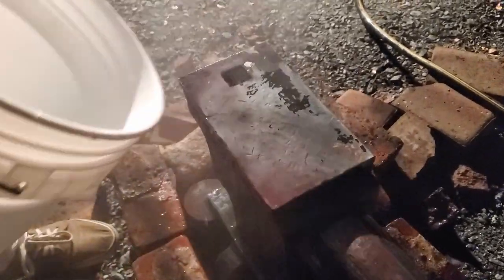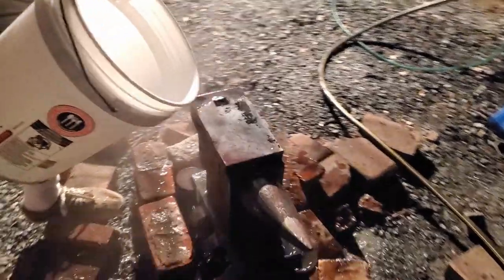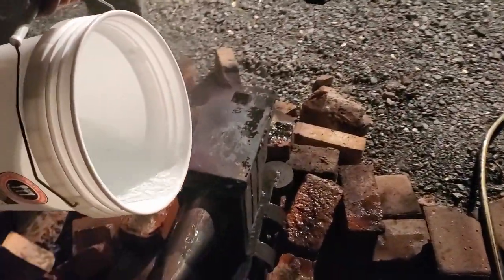It'll skate a file, which it would never do before, and it'll survive hammer blows without denting or dinging — which absolutely wasn't the case when it was annealed. We can already tell that instead of leaving dents it's leaving shiny spots with the hammer, which is so much harder than it was before. It may not be perfect — frankly we don't know what the hell we're doing — but it is so much better than it was.